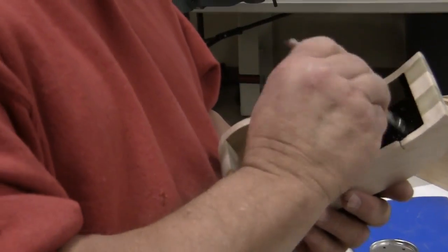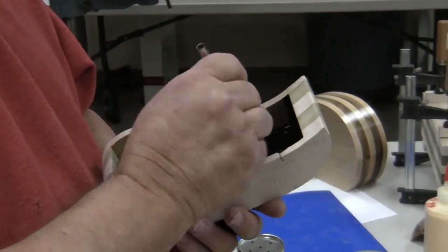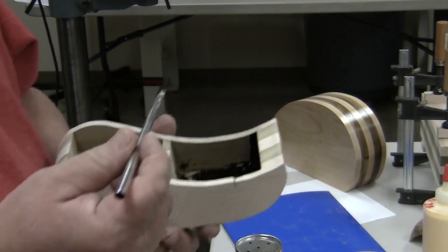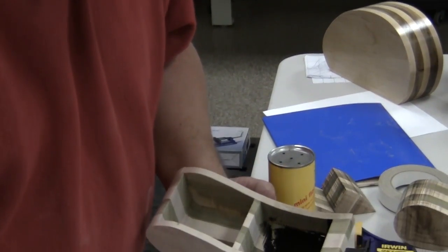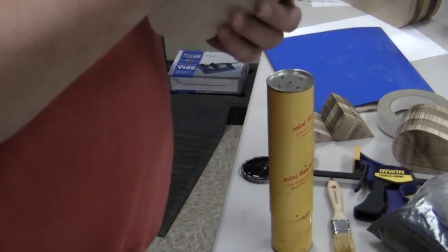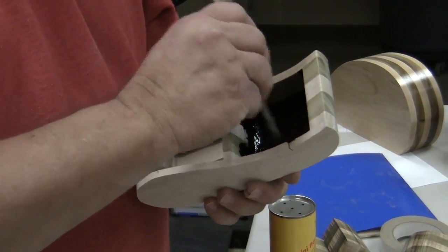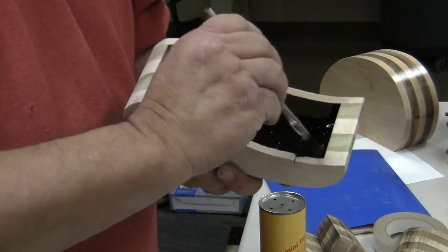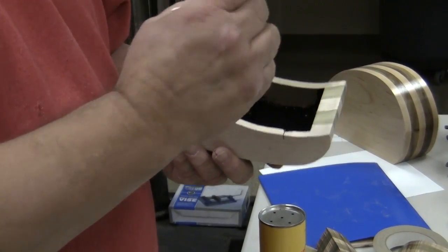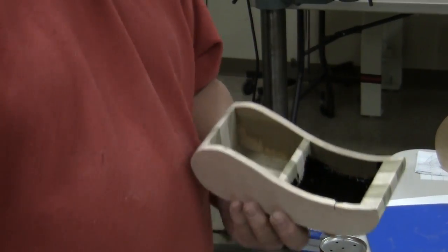What's your working time, Rob, with that adhesive? About 10 minutes? No. Really, it's only about 2 or 3 minutes before it starts to not be so tacky and you have a hard time putting it on. But as long as you get it on there and you keep it wet, like the part I already did, if I go over it when I'm about done, it'll be fine. But you want to keep it pretty level, because if you've got any bumps where you've got this on too thick that you didn't flatten out, you're always going to have a bump in there when you're done.